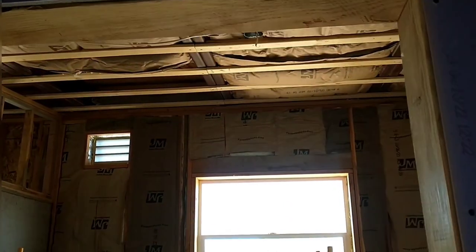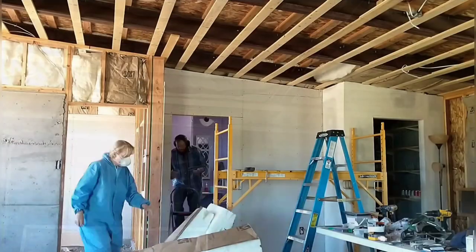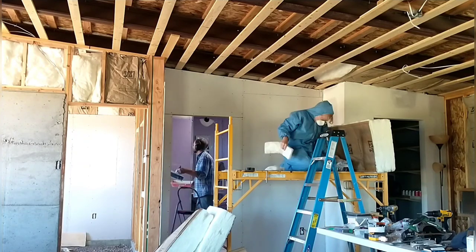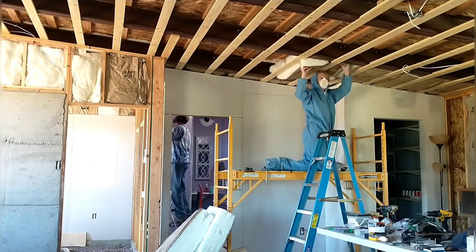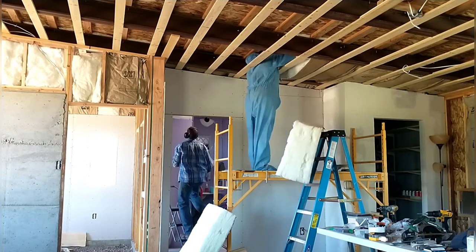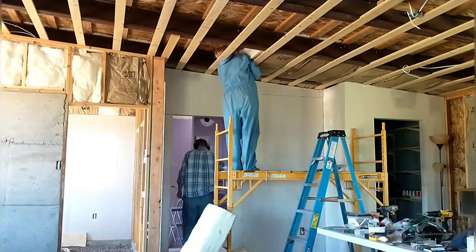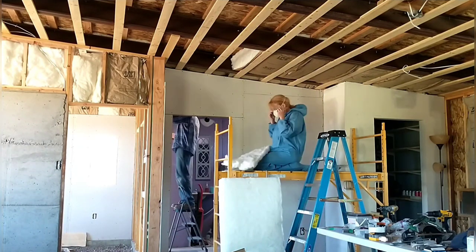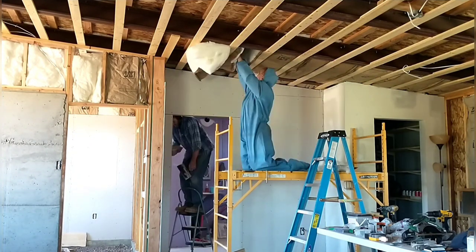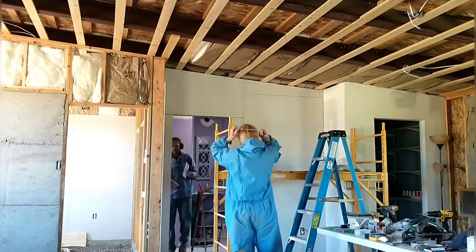April's been working ahead of me and is almost done with all the insulation in the guest bedroom. While I'm applying mud in the bathroom, April's working on insulation out here. It's been a challenge because we really need to start on the lower side of the house and work our way up the ceiling in one continuous movement so we don't get a gap between insulation layers — just putting one piece after the other and keeping them really tight. She's also putting little pieces of insulation on top of the beam in between the beam and the sheeting in that small space between the purlins — about an inch and a half by three inch space — but she's filling those up and making sure it's all tight and full.